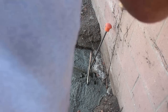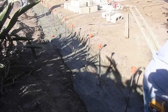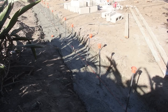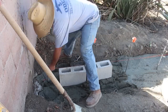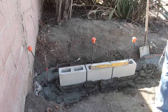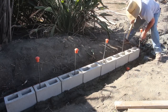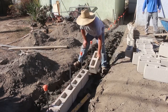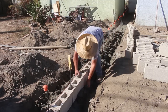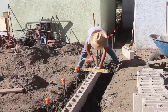Now I'm going to double-check my grade, mark my stake, and pull a line from one end to the other, then start wet-setting some block in the wet concrete. The nice thing about these small round rebar protective caps is I can still get a block over them. If I had the big four-inch square ones I'd have to take them off already — then I'd be exposed to a hazard if I fell on them. With these small round ones I can actually place the block right over them, which is a real advantage.